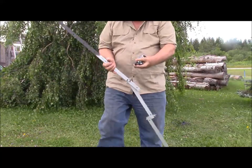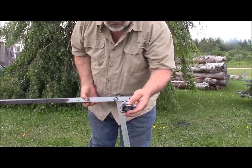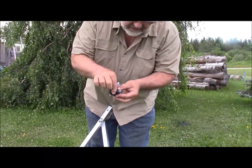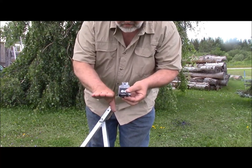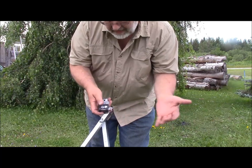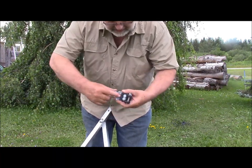This piece here, right here, is the little bracket that came with the Hummingbird fish finder. And it's exactly as it was. I haven't modified the bracket any. It's got little serrations on here and the bolt through, and the transducer fits in here and you tighten up the bolt, and these little serrations allow you to tip or change the pitch of the transducer if you want to when it's mounted to your boat. So I probably won't use that, but that's the way it came, so that's the way it is. My thought was, I've got a configuration this way and this way.